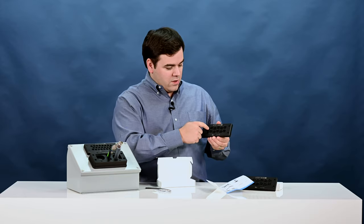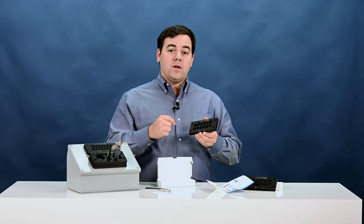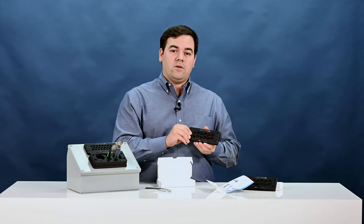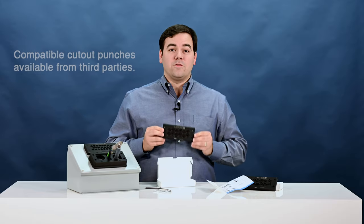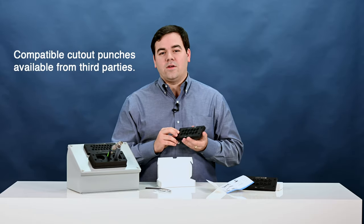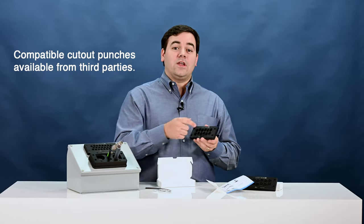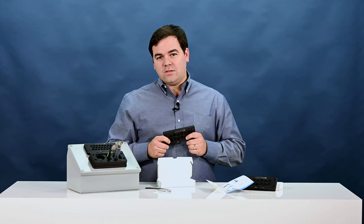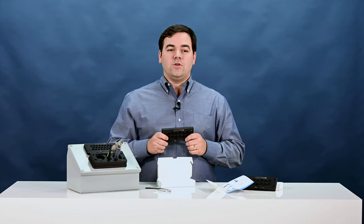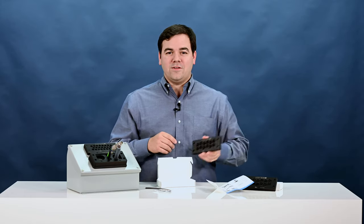That's because with this product, not only is your density much higher than you can achieve with a cable fitting, but you also only have to make one cutout. This is compatible with a Han 24B connector — it's very common in the wiring cable and connector world. Multi-conductor connectors are often used to this Han 24B standard, and what that means is there are a lot of third-party punches available. So you don't have to worry about drawing out that cutout — you just buy one single hand punch and you can knock this out in no time.